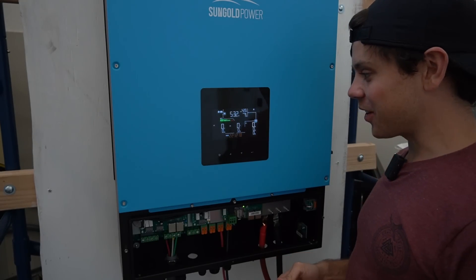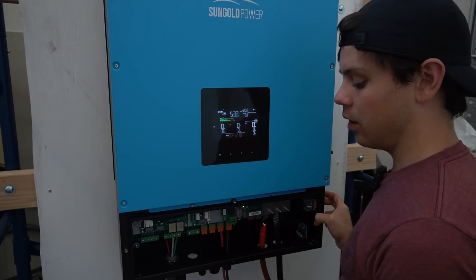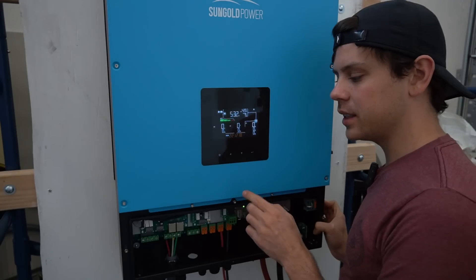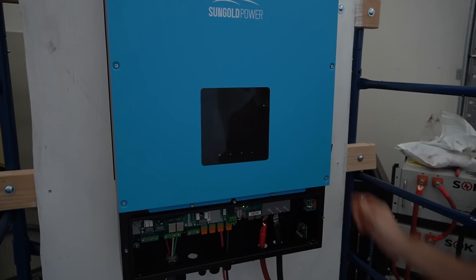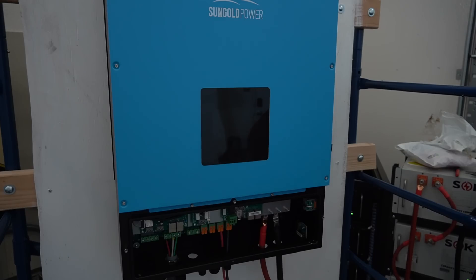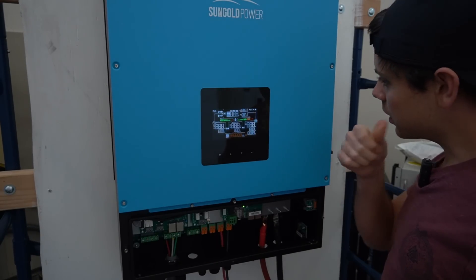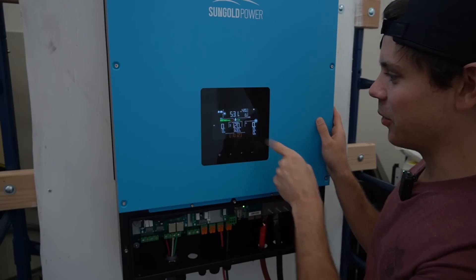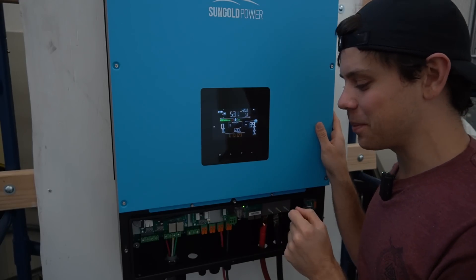We had it on last night and charged the car for a bit. It needs an on and off switch just like all the other models — you should be able to turn the inverter output on or off. This cold start button thing is not a good idea. Let's try disconnecting the battery and the solar array and then turning it back on again. There we go — now it's actually off. The capacitors had to discharge. Now let's turn it on, turn on the solar, now we're charging. There we go — 120 volts. So now it's on.